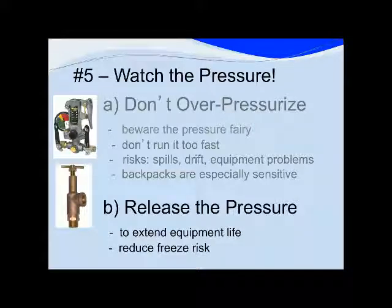When you store equipment under pressure, you're reducing the life of hoses, gaskets, and o-rings, and keeping guns, filters, and everything else under pressure — reducing the life of all your equipment. And if it's under pressure at night and there's a freeze, you're going to destroy something, guaranteed. So we recommend releasing the pressure at the end of every stop. You can give it a little extra squirt or put it back in the tank if it's a power sprayer. You'll eliminate a lot of problems.